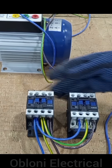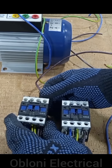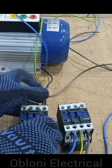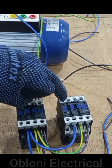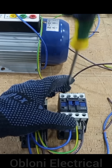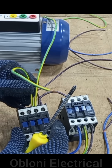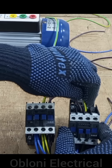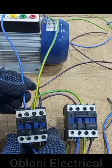The interchanging will happen at the output side of these contactors. From the output I'll take brown to T1 and take a loop from the same T1. From T2 I'll also take another loop, and that loop goes to T2. Then the third wire to the bottom goes to T3.